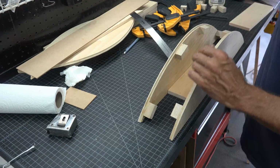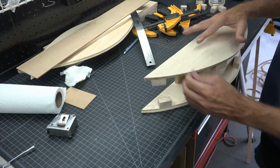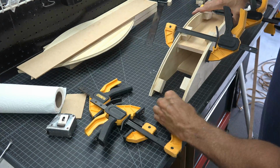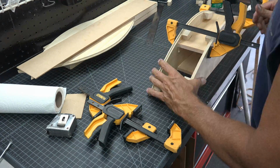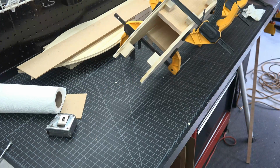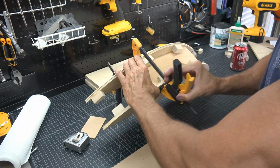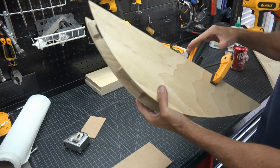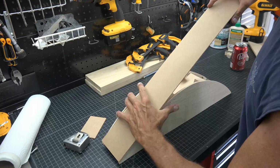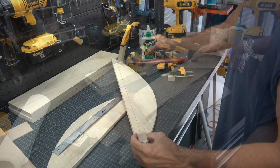When I went back to attach the faceplate, this is when I was trying to stabilize the arches just so I could get it attached. And I realized, hey, I should have made my blocks long enough to attach both arches, then I wouldn't have this problem. So while I was doing this with scrap pieces, I thought I would just go ahead and use the pieces that I picked up to join the back sides of both arches together. Now my faceplate would have plenty to tie into without me worrying about splitting the arches with brads. But don't attach them to the arches yet.